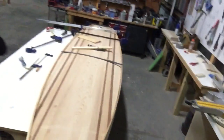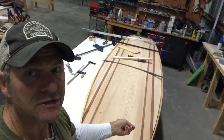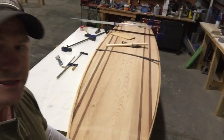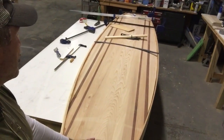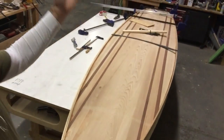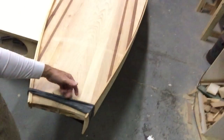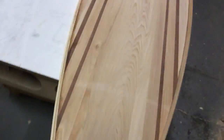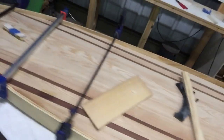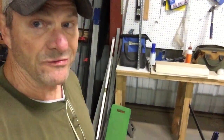I don't know about you guys, but I have not had a good time bending these rails. I mean, the radius on these bends is not all that great, but man, it's like a calf scramble, wrangling these things in place. And I've got all the clamps in my shop on them. I've got bicycle inner tubes, all kinds of stuff. And I've steamed them, and maybe I just can't get enough steam on them, but that does not seem to be much of a solution for me.